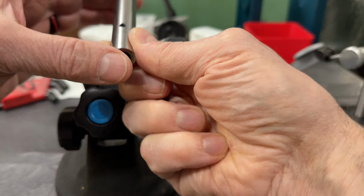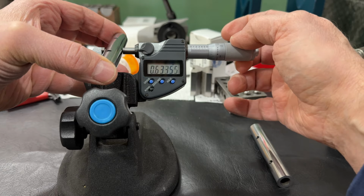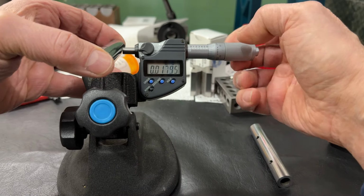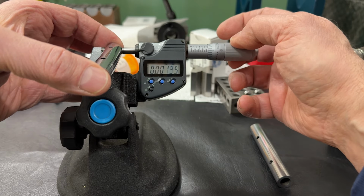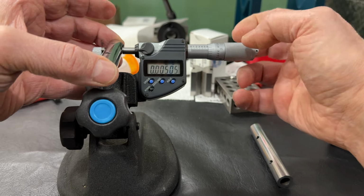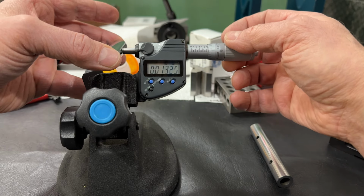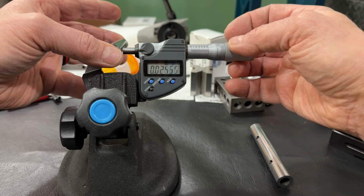Then we moved on to looking at relative measurements again. First, we're setting up with one roll. We're measuring the center of it, and we're establishing that as our reference. And then we'll go and hit 5 points on each roll to check for its relative value. So at the top of that roll, there was maybe a little bit of something going on, but basically everywhere else we found 0, 0. So within 50 millionths, these are also on size.